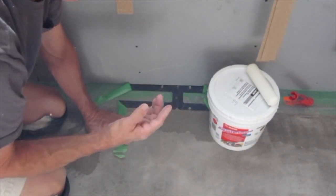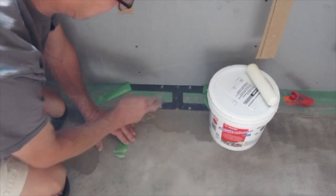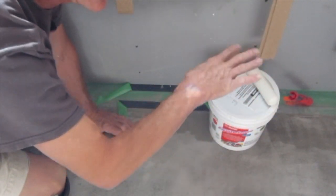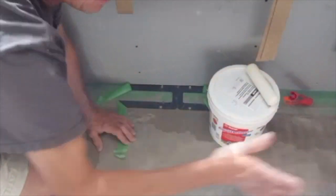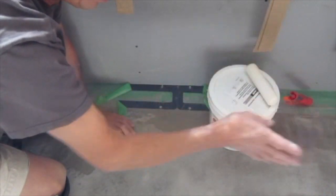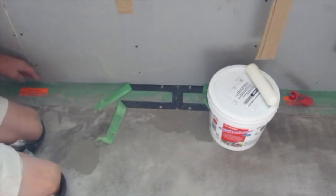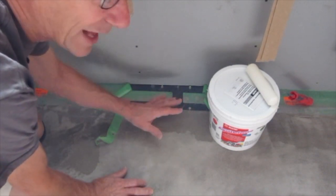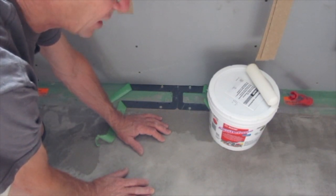If you're doing the liquid waterproofing, it comes with a fiber tape in the package. I'm going to fold and tape all of my corners. It also comes with inside and outside corners, depending on what you're using. After I get my Aqua Defense on in one layer, I'll put the corners in, tape all of my edges, tape this seam, tape any other seams that you may have in your pan, and let all that dry completely, and then come back with a second coat over your tape and over the entire pan,